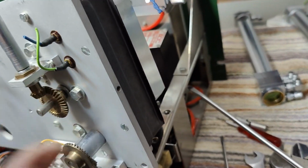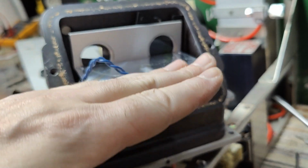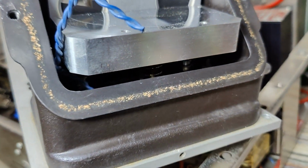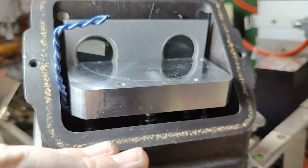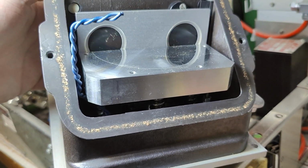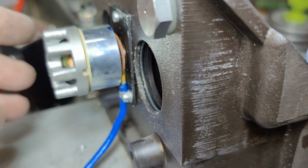The mechanical adjustments here, what they do is they move this one up and down and it tilts. So the other one is the tilt and that one is the up and down. I try to lift it as much as I can to show this, but there's no way I can get in there easily. But that is what is going on for some final super timing adjustments, and because of this little shutter thing. And by the way, this motor is a 3-phase motor and it's super good with the bearings.